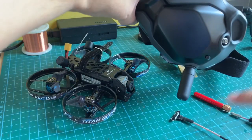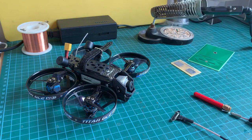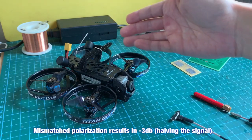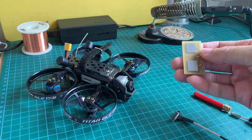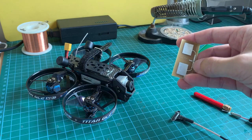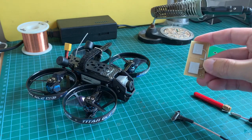If you have two pairs of the X-Air antennas you get really good performance, but we can't use the X-Air antennas for our project because they are circular polarized. Using circular polarized antennas on the receiving side to match linear polarized antennas on the transmitting side means you lose 3dB of gain. To solve this problem on the goggles, we could use patch antennas which are linear polarized, like this one here — this is only 9dB — but I'm going for a higher gain antenna with a wide beam just like the X-Air.